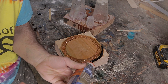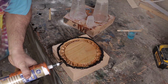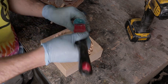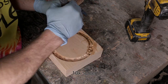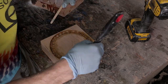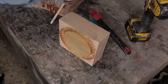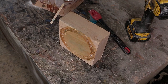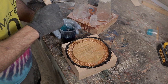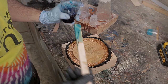After I have it off the CNC machine, the first thing I'm going to do is use some silicone sealant around the edge of the piece to contain the epoxy so we can over-pour it a little bit without it going over the edges. I forgot to do the silicone sealant first and went ahead and sealed it with quick-sealing epoxy instead — check my description for exactly which epoxy I'm using. It will start to firm up in about 40 minutes, which gives me enough time to seal and prevent leaks and air bubbles.